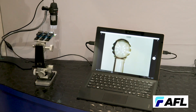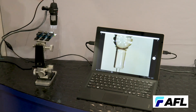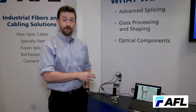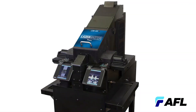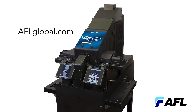The machine then translated, broke the 400 micron fiber, and created a nice 1.2 millimeter ball lens. The potential applications include axicon ball lenses, tapers, and any number of shapes — essentially, as long as you have an idea of what you want to do, this machine can help facilitate your glass shaping needs. This has been an example of three different components this machine is capable of making, but it can make many more. To see what it can do for you, visit us at aflglobal.com.